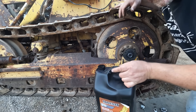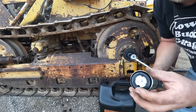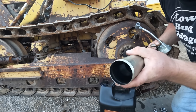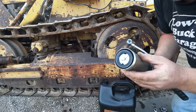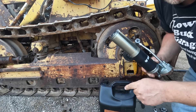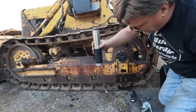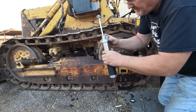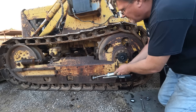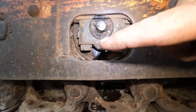I got to get this gear oil in here. I'm using a suction-type grease gun — not only can it use cartridges, but you can also dip it into a vat, pull the piston, and it'll suck up the fluid. There's a rubber seal in here and I'm hoping it'll hold the oil in. We're full of gear oil — I don't see any leaking at the bottom. I pumped them until oil started oozing out the roller, so hopefully we're in better shape.